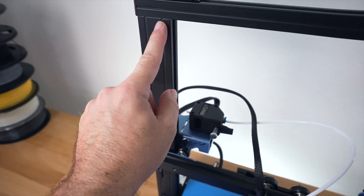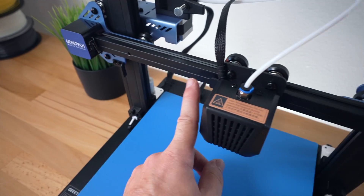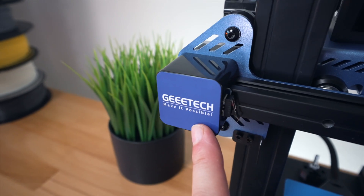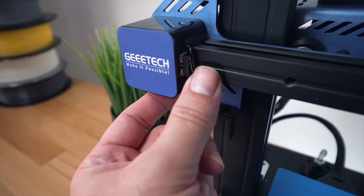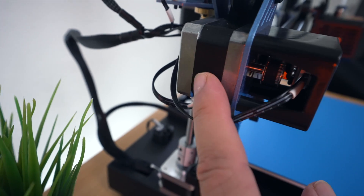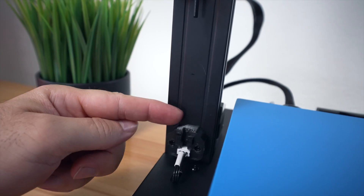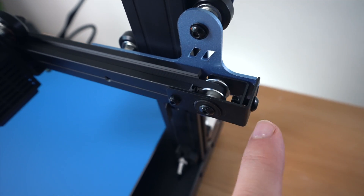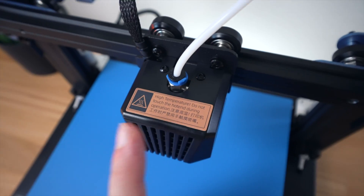Back up front, the channels have a smooth finish with a groove — a nicer finish than usual. On this side there's a little cap with the G-Tech logo. The X-axis end stop switch is the normal mechanical kind, while the Y and both Z's are sensor style. This is the X-axis motor and gear. Below that metal tab is the Z-axis end stop switch, and on the other side is where we adjust the X-axis belt.